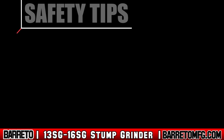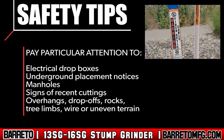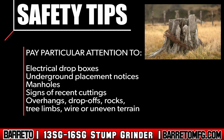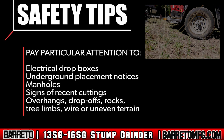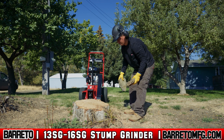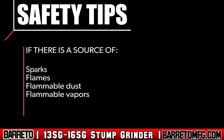Pay particular attention to electrical drop boxes, underground placement notices, manholes, signs of recent cutting, overhangs, drop-offs, rocks, tree limbs, wire, uneven terrain, any existing trenches or holes, or any toxic ground conditions. After doing an assessment, clear the area of debris, branches, and rocks to the best of your ability. If there's a source of sparks, flames, or flammable dust or vapors nearby, do not operate.